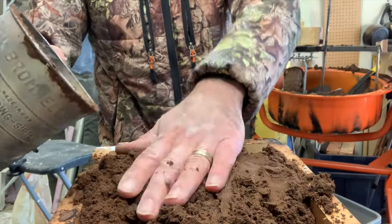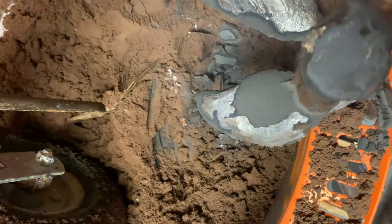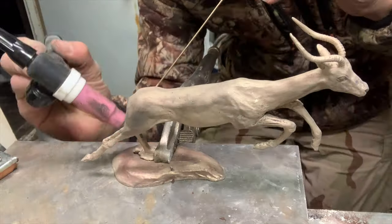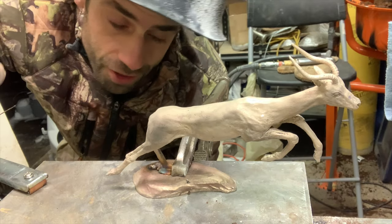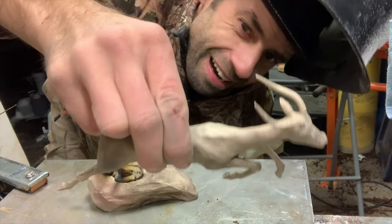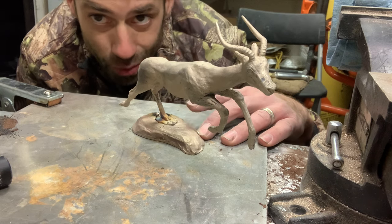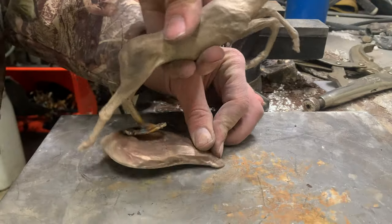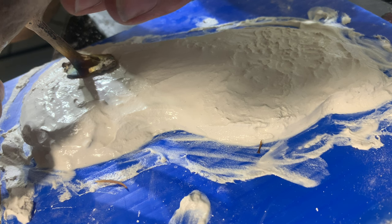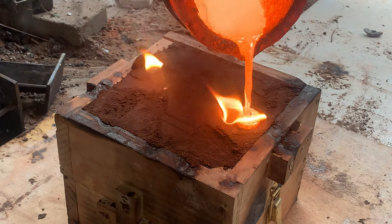For the base I used the process of sand casting — it's a lot quicker, easier, and cheaper compared to lost wax casting. But it didn't balance, so I had to remake the base. I whipped up another base with plaster, sunk in the footprint, and textured this one with a walnut. Re-sand-casted it and gave it another try.